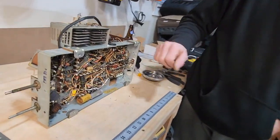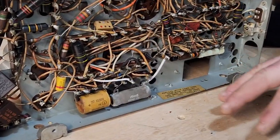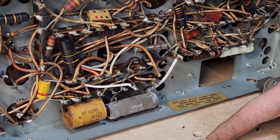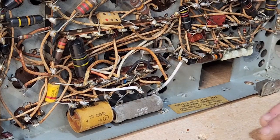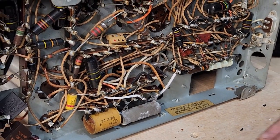We found that one of the primary transformers coming in is supposed to spit out two voltages: 110 volts in, supposed to have a 24 volt output and a 6.7 volt output. The 24 volt output side had high resistance, a lot of ohms. So we suspected it's bad.